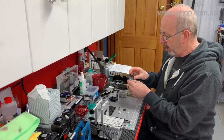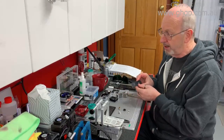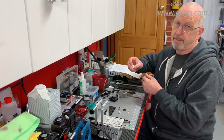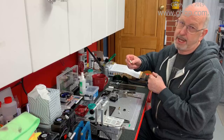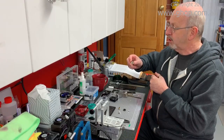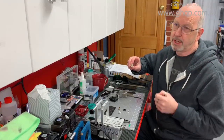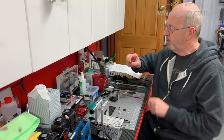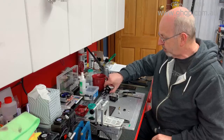I did lots of engraving tests and created scales to determine the width of my laser beam, which I go through in detail in the video. I also did cutting tests — where previously it took about six passes to get through a piece of 4.5 millimeter plywood, I was able to cut through it within two to three passes maximum. I set the focus distance not at the surface but about halfway through — around two millimeters deep. With the tight focus I've got, there was very little charring around the edges. The same result applied for three passes to cut through 4.5 millimeter black acrylic.